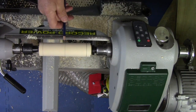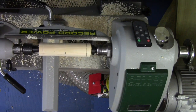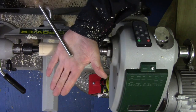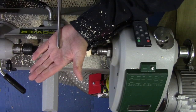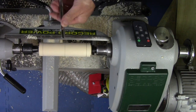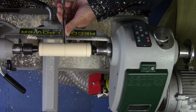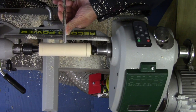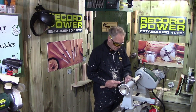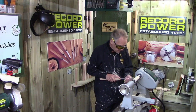I'm going to create a bead. This is the third tool in your spindle turning armory — the spindle gouge. This grind is straight out of the packet, which is the traditional spindle gouge grind. My finger is in line with the flute, thumb positioned, bevel rubbing. I lift the bevel up at the back, then pull it around into a bead and out — physically moving your hand around. There you have a bead cut into the material.